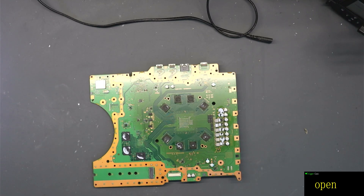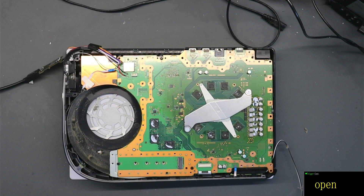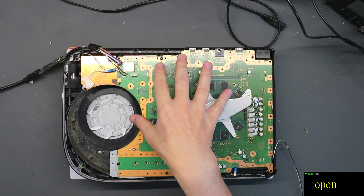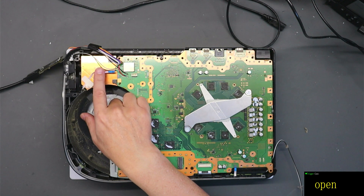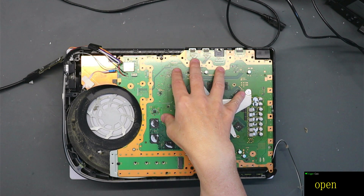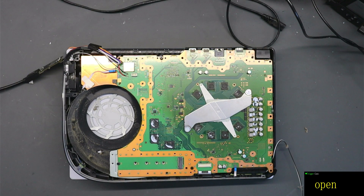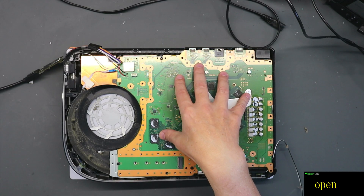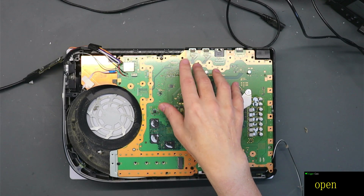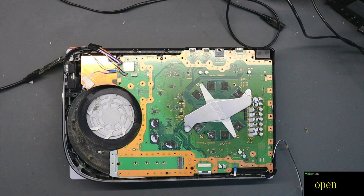With our UART hooked up, we actually had a load of error codes. We cleared those off, plugged everything back in again minus the LED cable, recycled the power, and then read the error codes again - and we got no error codes. Which is actually quite uncommon. You normally see some kind of error codes with these beep on/beep off type issues. But what was the different thing we did? We didn't plug in the LED cable.